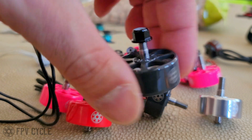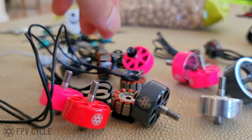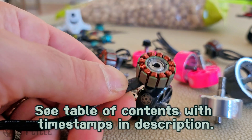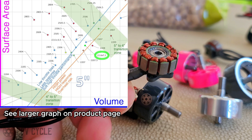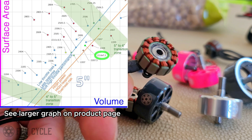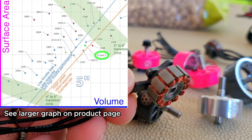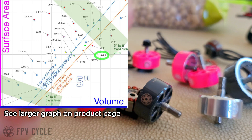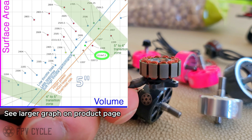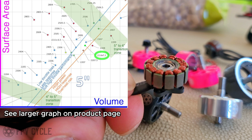But this is actually one of our new motors. It's a 2809 motor. And another new motor that we have is the 22.6 millimeter motor. This stator is based on the Wasp motor stator from RCN Power. But this is a 22.6 by 7.2 millimeter stator. This is a really nice size — I think 1920 KV. The numbers on this motor are very nice. It just really performs super nice.